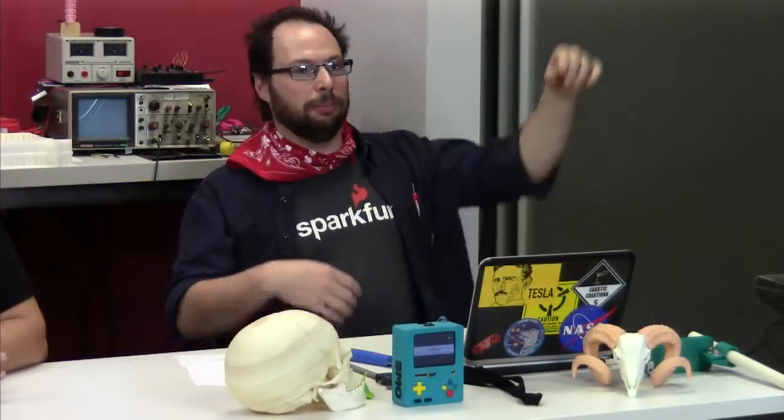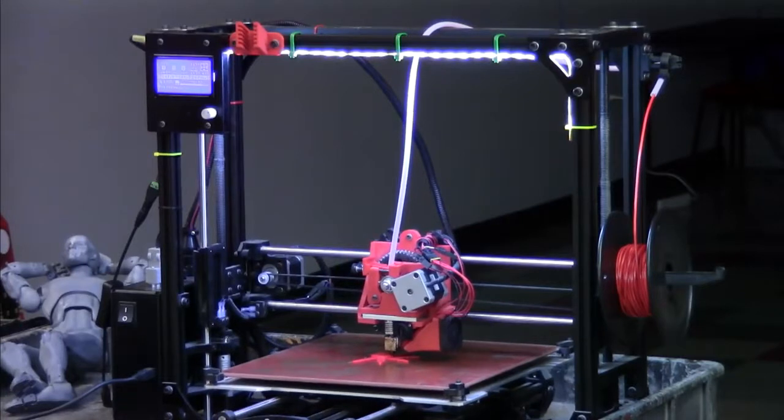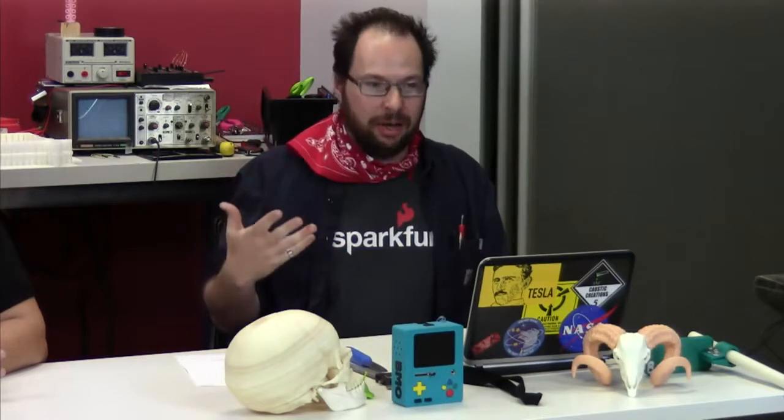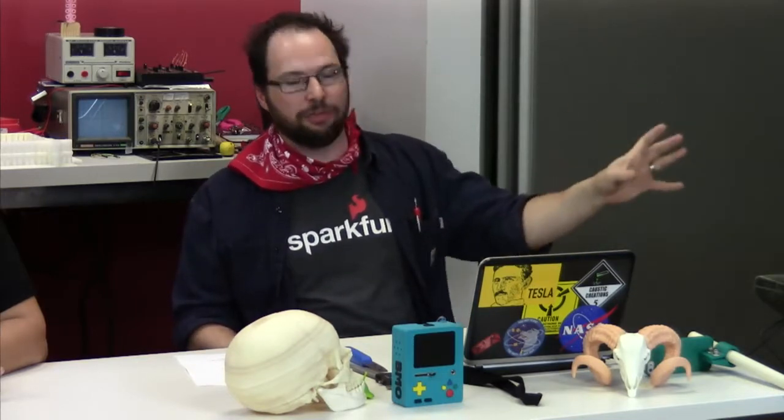And actually, speaking of damage to the printer parts, another problem, this is the rarest and the last problem that I'm going to talk about troubleshooting for, is failure of electrical components. Now, inside that box is just another circuit board, and it's subject to all of the woes of what electronics can be subjected to. So I had a backdriving problem, and it actually overloaded the stepper circuit on the controller board. Now, if it wasn't me, that could have been a problem, but because I work in a place that is very much an electronics factory, I had access to a few tools and a little bit of expertise, so I was able to simply pull the board out, disconnect it from the printer, and do a little bit of electronic surgery, as it were.